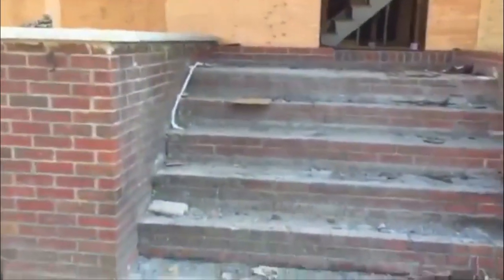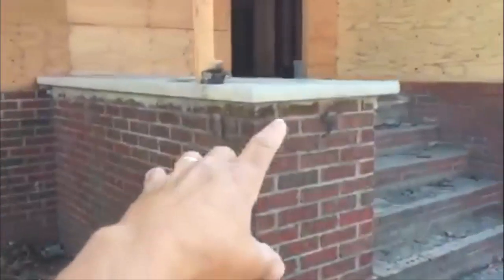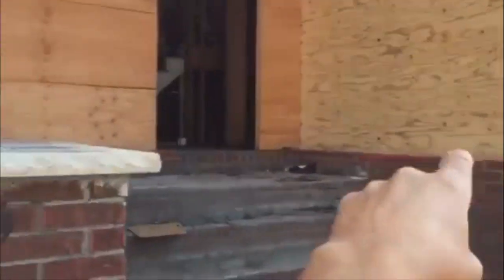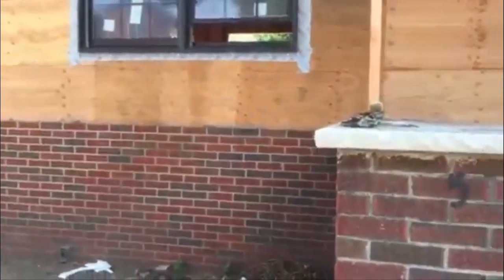Let's go in the house. We just installed the stairs yesterday, so now we can make our way through. As you look at the entry, all the brick from this corner over is going to be a decorative stone — a gray Calgary gray dry stack stone — wrapping this whole section. We already installed our limestone treads for the column. The masons are going to come and install new limestone treads to match the column, then cap the brick off with a limestone tread all the way around the house, stucco and color it, and then from that cap up will be the HardiBoard.